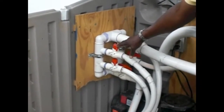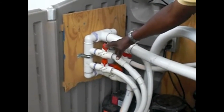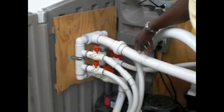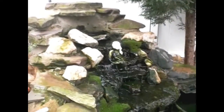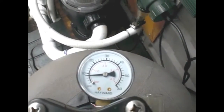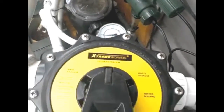With this control array we can actually control the water going back to the bottom jets of both ponds through the UV light and back to the waterfall. Noticing the slow flow of the waterfall is one indication that it is time to backwash your system. Normally this system runs about 2 PSI. When it is above 2, maybe 3 or 4 PSI, it is automatically time to backwash.